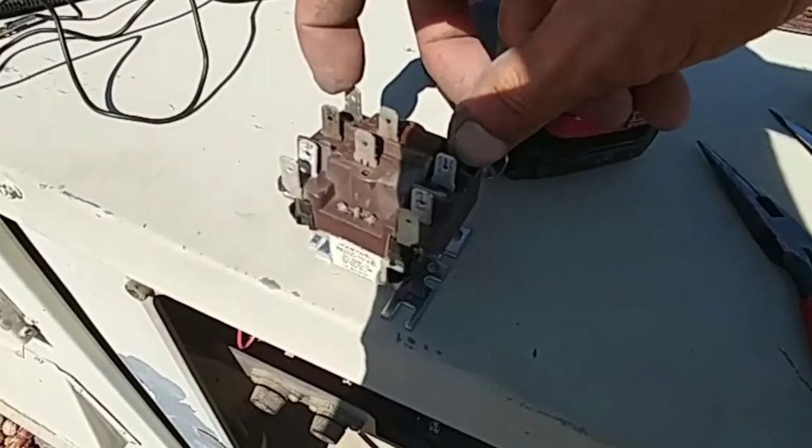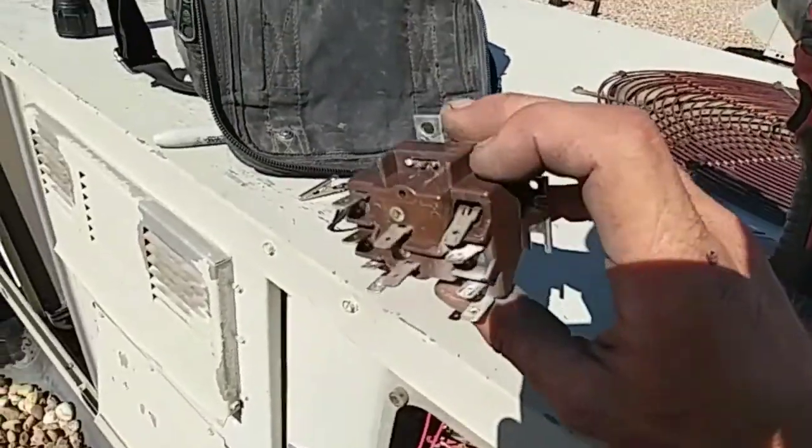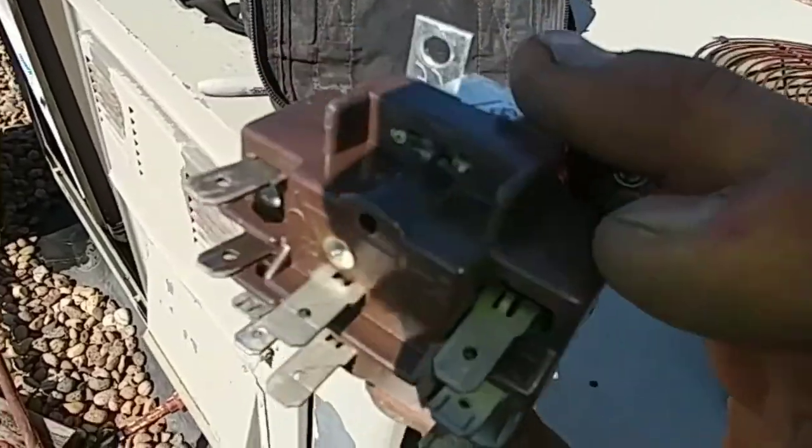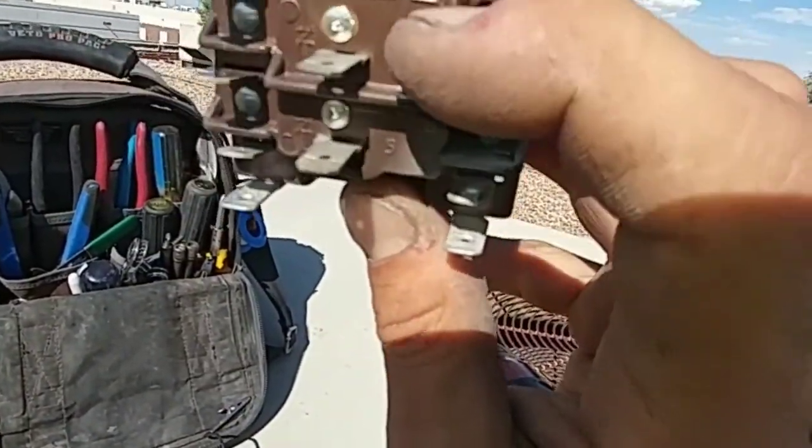What I noticed is that I had 24 volts here but I had 208 right here. So that's telling me — if you have 24 volts here, the contacts should close; if you have zero volts right here between this, that means the contacts should not be closed on these two outside pins. So if you have 24 volts between your coil, take your meter, do 24 volts — these contacts will close, and you're going to read zero across here if they're closed. You're not going to read 208 or 120 or 24. But this thing's fried, you can see it.